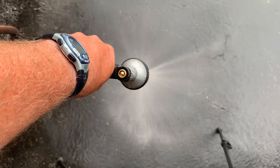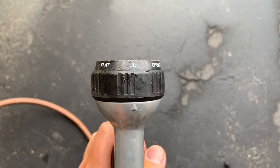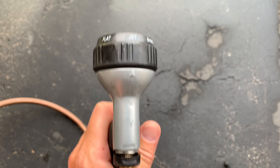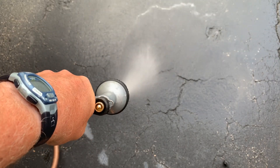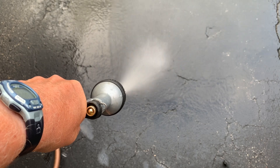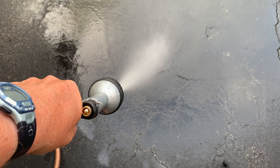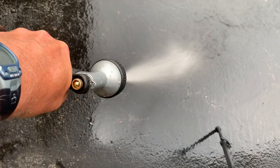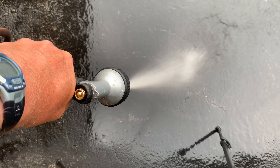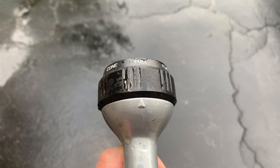The cone representing 83 kilohertz would be the 60 degree cone angle. The jet setting on the nozzle would be very similar to the 200 kilohertz — you can see it is a strong, defined pulse that would work well in deep water. The 200 kilohertz corresponds to the 20 degree cone angle.